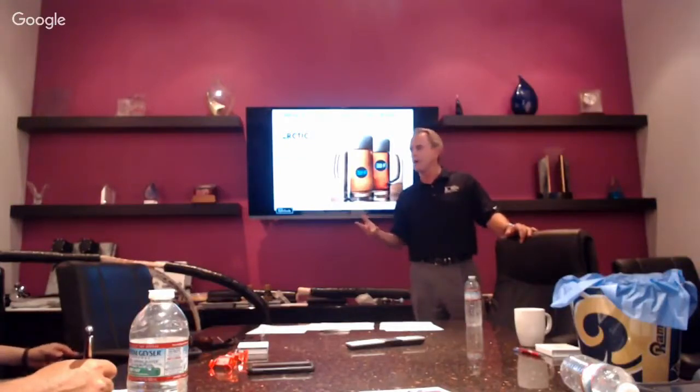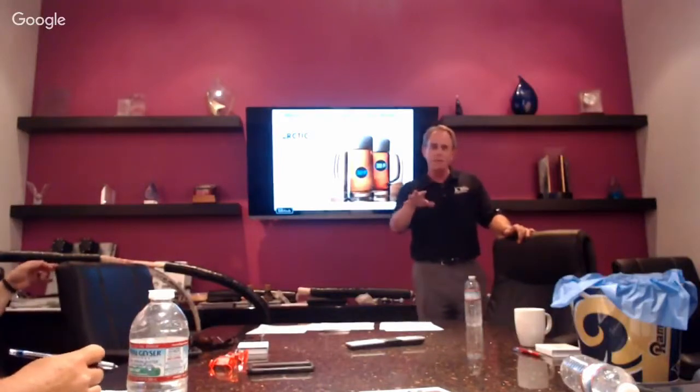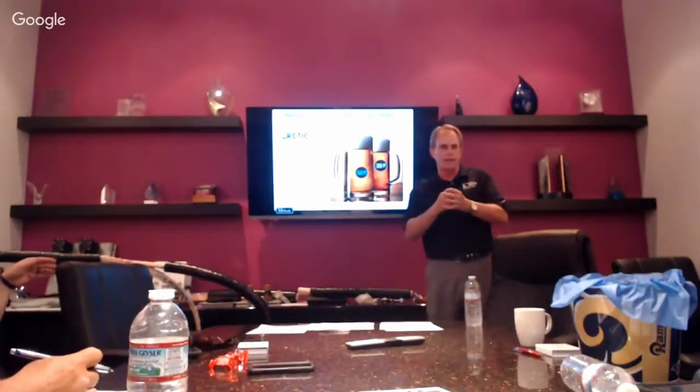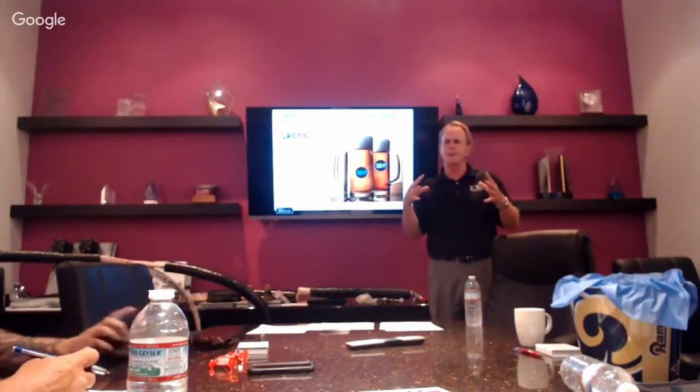Now, if it's 120 out like today, you just mowed the lawn, for crying out loud, there's nothing better than a 32-degree beer. Okay, aside from that, if you're doing this for a living to sell beer for profit, and you give somebody a 32-degree beer, what happens is at 32 degrees, that CO2 is locked in. You're not getting any foam, looks like the beer's flat, and that CO2 is locked into the liquid. And what happens when that cold beer hits your stomach? You ever had that bloated feeling? You're burping all the time? You've got a lot of CO2 release inside your stomach.